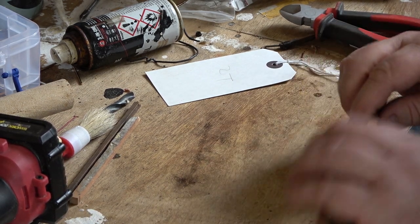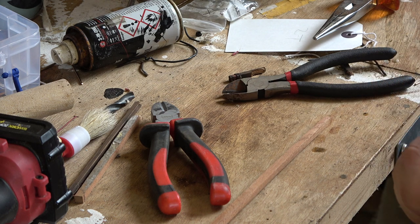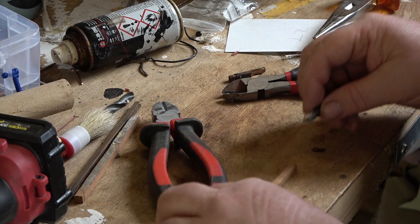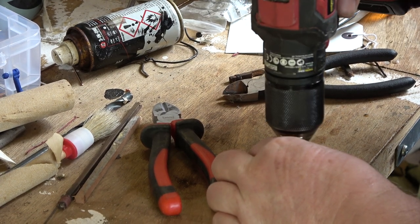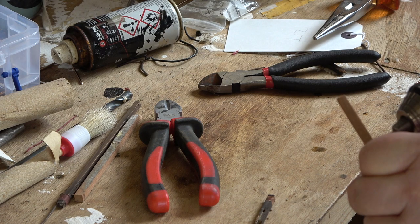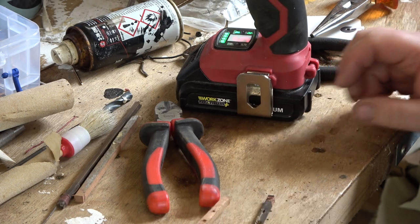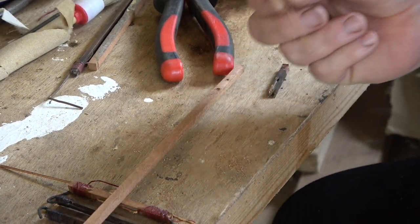I've cut that. What I've got here is an old end to use as a guide to drill the new ones in the kind of place they were originally. I'll place that on the timber - we've got a one and a half millimetre drill which works out for the 16 gauge. Drill through the two holes - there's a pilot hole. We've had some wire left over from when I did the pull down, so I kept that. These are just right to make these wires and it's the right gauge.